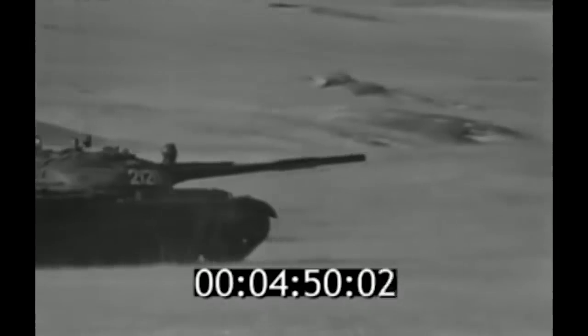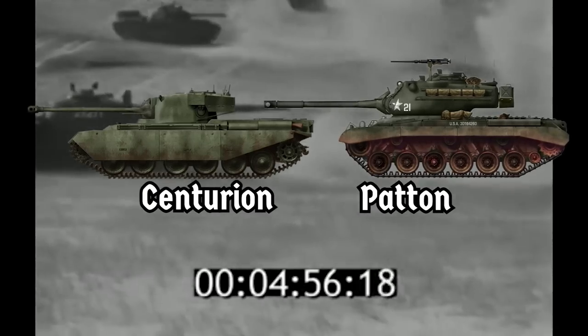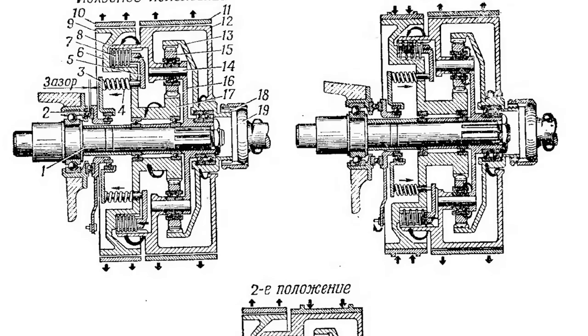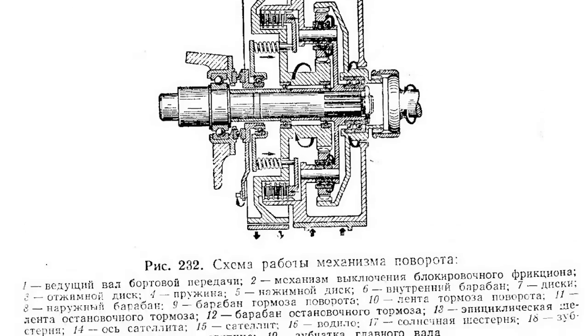The concept of implementing minimal gear reductions in the drivetrain until the final drives became common after World War II, both in tanks and in commercial vehicles designed to bear heavy loads across difficult terrain, including tractors and off-roading trucks. The transmissions of tanks like the Centurion and the Patton series were also designed according to this concept, and both used spur gear final drives with a high reduction ratio. Out of all the positive effects from this design solution, the most important for the T-62 was that it increased the service life of all drive units downstream of the intermediate gearbox.